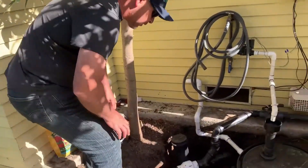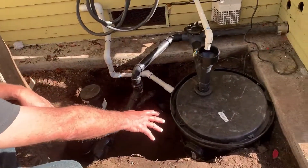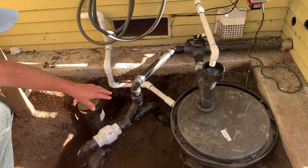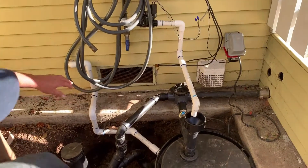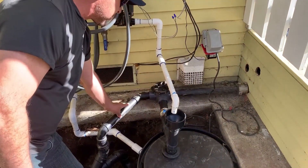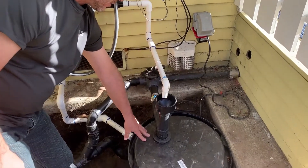What we have here is a new sump pump, or tank. The way that it flows is that the gray water comes through this three-way valve. Right now we have it cut off from the sewer system, and it'll flow into this tank.